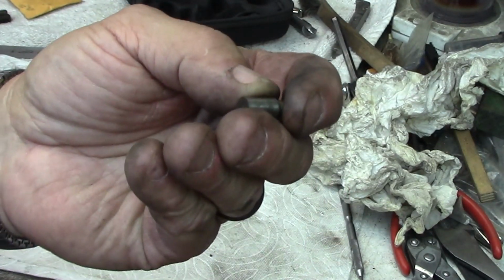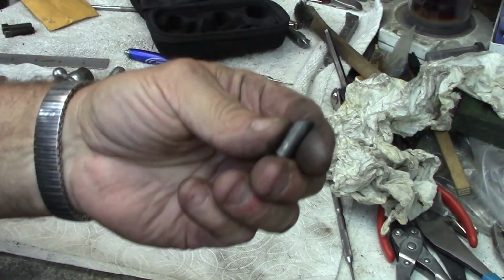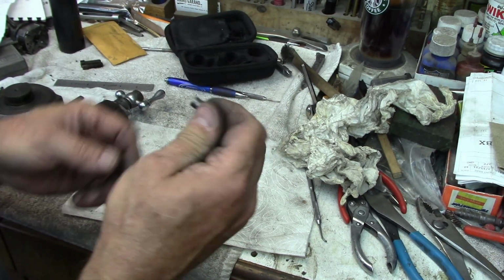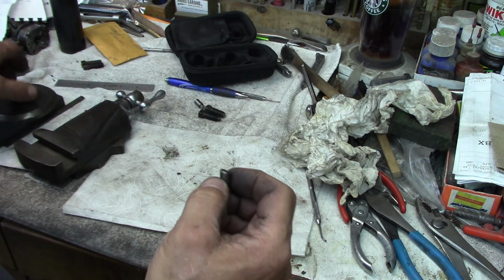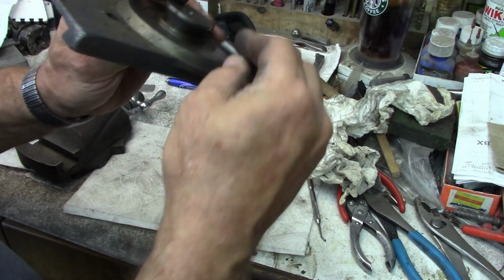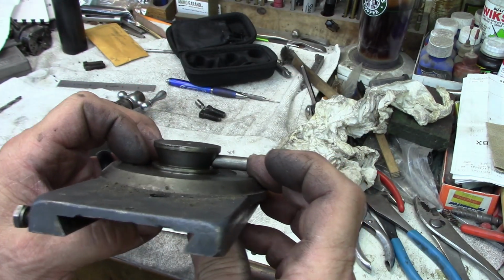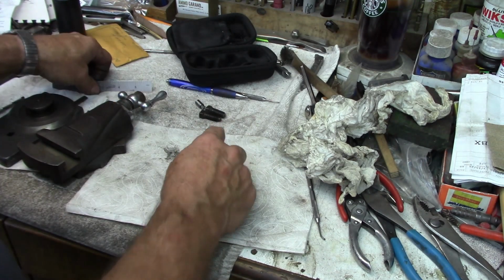Maybe that's what came out of a 6-inch lathe, maybe not, I don't know, doesn't matter. Anyway, this is the ones I'm used to seeing for the 10 and the 12-inch lathe, just like this. And all that is, we're flat on the back end that we push against. We've got a bevel, which I imagine is a 60 degree, 30 degree, however you want to measure it. And all you have to do is match them up to that angle right there. That's all it is.